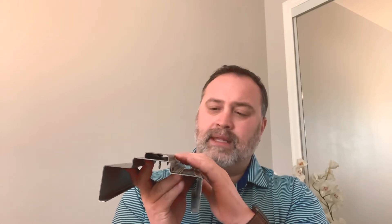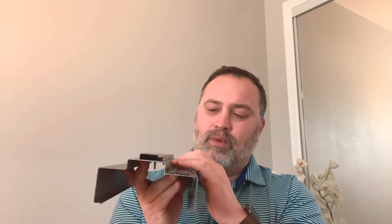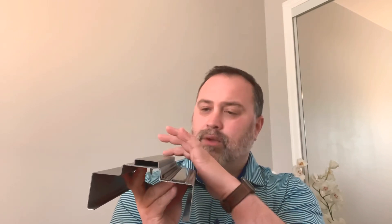The first part, which is mounted on the soffit, eliminates the gap that is found at the face of the door where it meets the stop. When the door is in a closed position, if you have a gap that exceeds one eighth of an inch, you would use this piece right here. You would slide it over until it meets compliance, mark your holes, and then fasten it with the provided self-tapping screws.